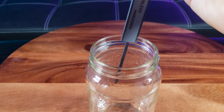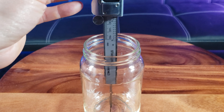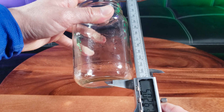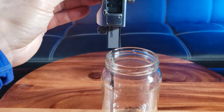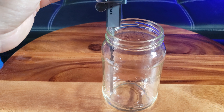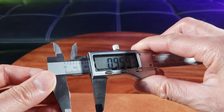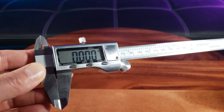Now for hard-to-reach places — imagine a very long jar or cylinder that you can't easily measure. So I'm going to measure the height of the jar first, which turns out to be roughly 5.026 inches. Then if I stick the depth probe down here — and don't forget the thickness of the jar — it shows me the depth of the hard-to-reach interior. It's recommended that after each measurement you want to zero it, because it doesn't always return to zero on its own. Simply zero it to recalibrate after each use.